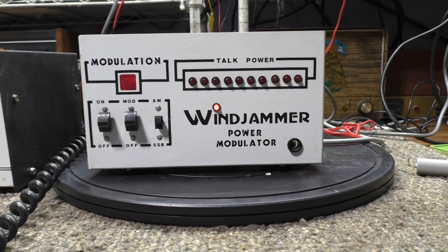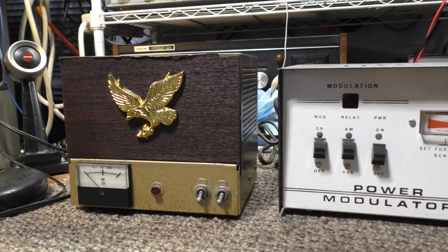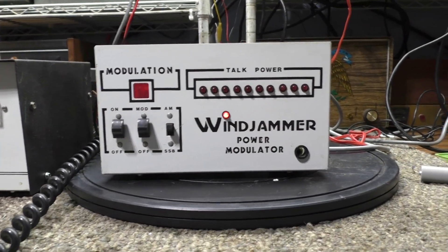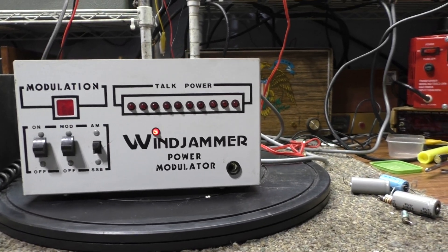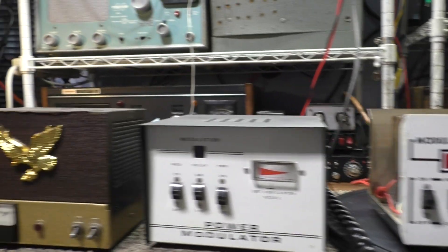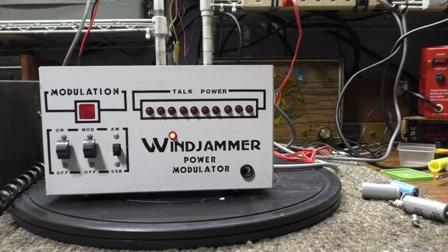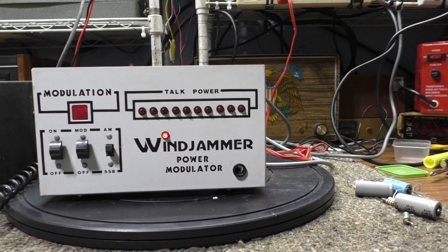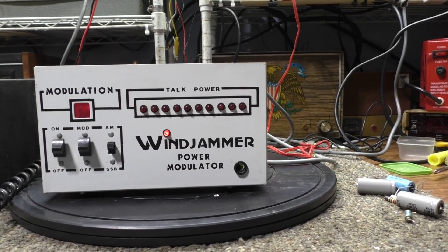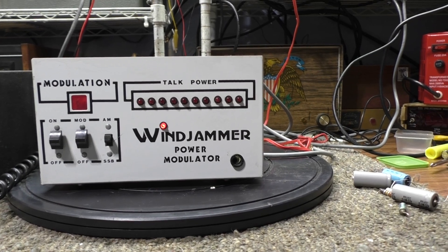The white Windjammers and power modulators run a little higher voltage — higher power, but they're nastier and they eat tubes. The JB12 pushes that little 6BQ5 hard enough and it's a tube eater, but these take it to a new level. The Windjammer is about the smallest of the low modulators you'll find using a single 6BQ5. Something like a Nexus JB150 uses a single 8417, and the Little Willy uses a 6LQ6 sweep tube, grid driven in tetrode mode. These little modulators are designed to dead key low and swing high — if you ain't got that swing, you ain't got a thing.